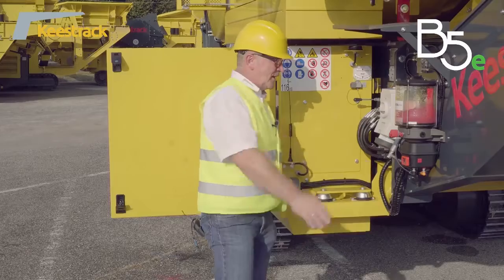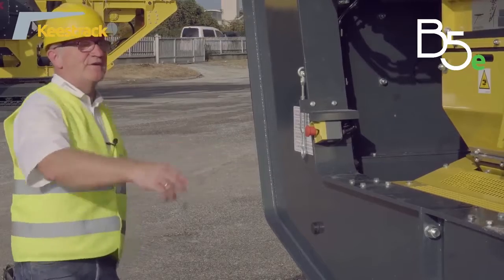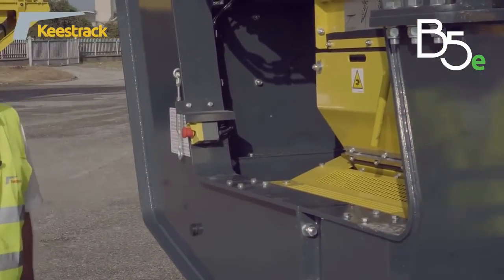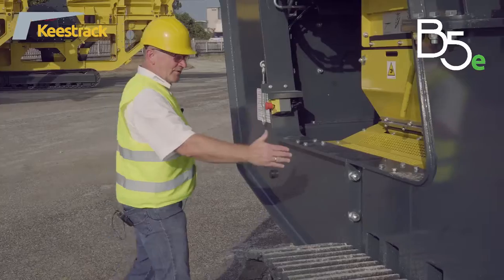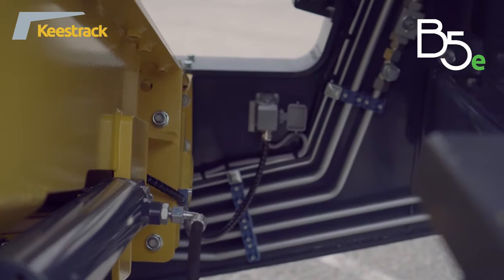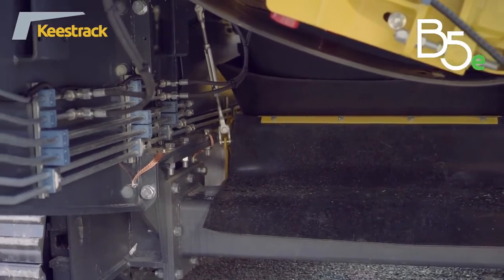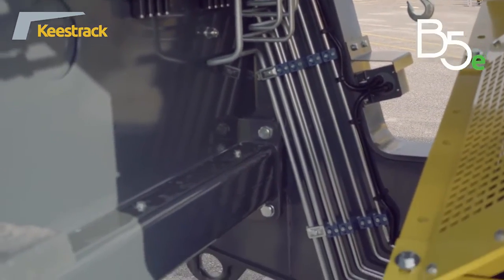Here we have the automatic lubrication system for the machine. So the frame of the machine is made of very heavy duty steel sections, and all of the parts are powder coated. It means the surface protection is the best you can do. Due to this reason, the frame is split in pieces so that it is fittable for powder coating. Here we can see the hydraulic hoses are mainly made, as I mentioned, of stainless steel pipes to bring out the energy in a very economic way.